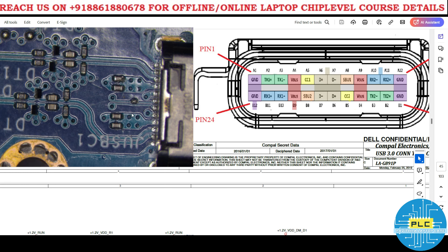Whether you take a mobile charger or laptop charger, VBUS will give only 5 volts initially when connected. When you connect the laptop, it also starts at 5 volts when you press the power button. Internally, it recognizes the power requirement — if the motherboard requires 20 volts, it will produce 20 volts. For mobile, it checks and produces only 5 volts by default.